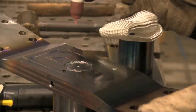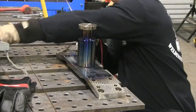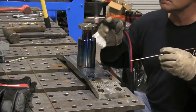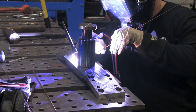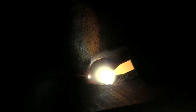You can see I'm propping right directly on that 500 degree Fahrenheit metal with my TIG finger, and that lets me make this whole weld without cooking my finger. Otherwise I'd have to find a way to prop my palm with a stack of dimes or something — I don't have to do that; I can just prop right wherever I want. A quick check before I put the first pass on this side to make sure I'm above 500, then prop the pinky TIG finger on there and go again. I'm using a water-cooled CK flex lock torch because I'm using quite a bit of amperage — the air-cooled torch I tried to start with just got way too hot. Going along nice and slow, keeping the rod in the puddle.